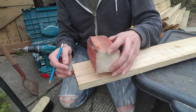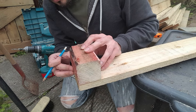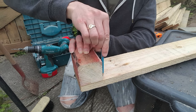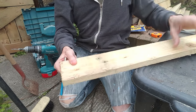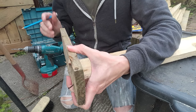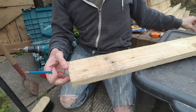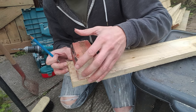As I said before, one side is going to have a flush finish, so I'm going to lay the upright right against the side of the plank and just mark it off. For the other side, I'm going to use a scrap piece of wood the same thickness as the planks I'm using and just mark down this edge.